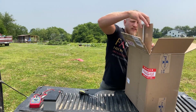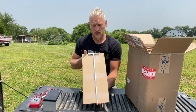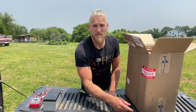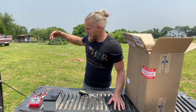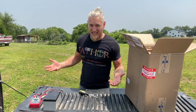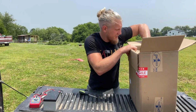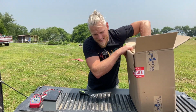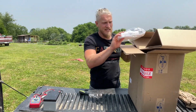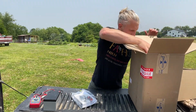All right, another thing I liked about this, it comes with a grounding rod, and this is all you'll need as far as a grounding rod for this thing. So I was pretty happy to see that. Because grounding rods have been a problem for us. With the charger we had before, it had to have the big, huge, deep grounding rods in the ground and three of them and all this stuff because it was like a cattle fence charger. And that was a pain to move around, obviously, for obvious reasons. When you're hammering stakes in that deep, it's a little rough to move. So with this solar charger, we don't need grounding rods that deep. We just need this single one right here, and it should be ready to rock.